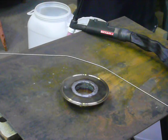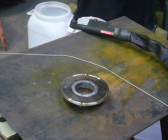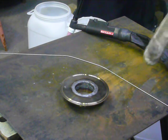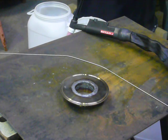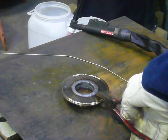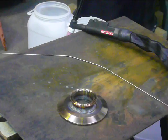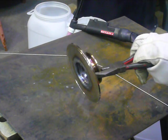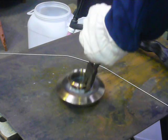This is the 4-inch to 2-inch reducer I've just welded up. I've got a 4-inch end plate, and I've just cut a hole, I've showed you in the previous shot. Drilled it out, reamed it out with a tungsten bit on an electric die grinder, and I've just welded the stainless steel ferrule, 2-inch ferrule, into the 4-inch plate. Hopefully I haven't got too much warping in there. Not too much. It's enough that a gasket can take that out of there.